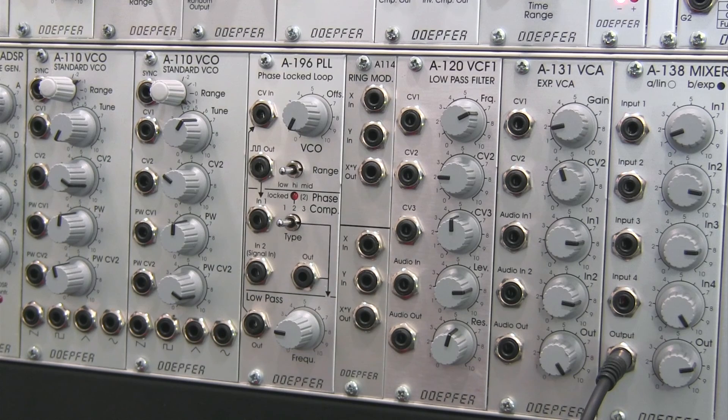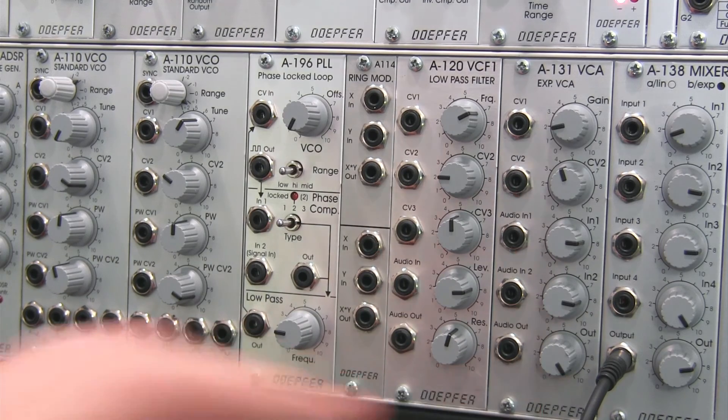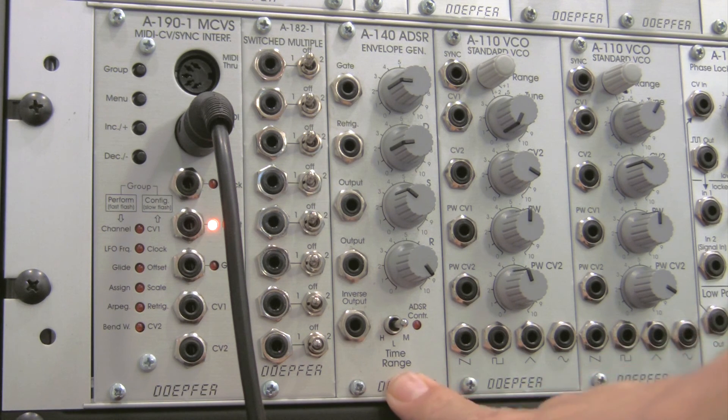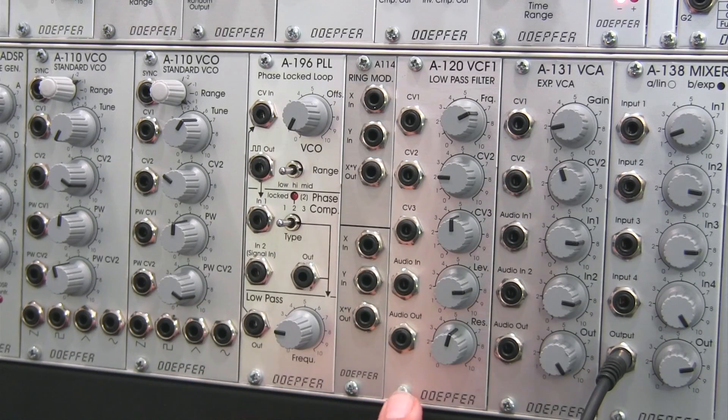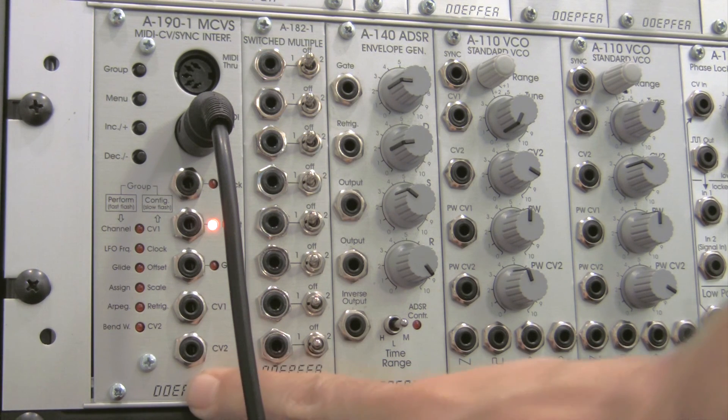In some preliminary tests I didn't feel like that was quite a thick enough sound or providing enough variety, so I decided to put my own spin on it. I decided to throw in a VCA, which in a little while you'll see how that integrates. For shaping, we have the A-140 hanging out over here, and this is going to be generating a control voltage signal fed to both the low-pass filter and the VCA to shape the sound — giving us either a short sound or a long legato-ish sound. The notes are going to be coming from the A-190 over here on the left.